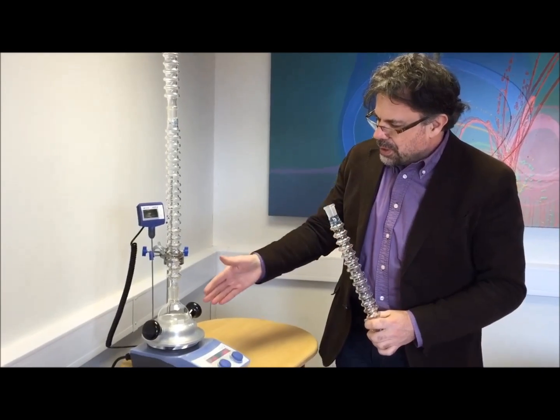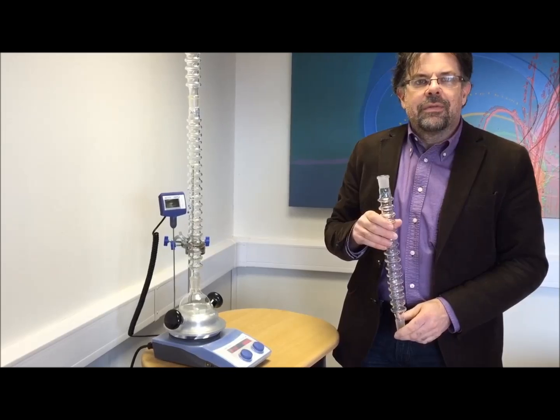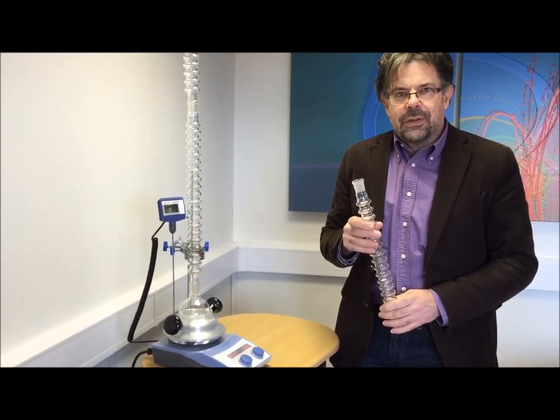For instance, with water around 120 degrees heating block temperature, one can achieve a reasonable reflux without it escaping a single condenser. Much above 120 degrees and one starts to see losses.